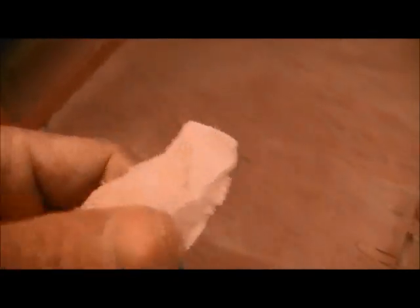It's now 20 to 30 minutes later. I have this pan out and have gotten down to the drain area. I also cut out all this excess tile and what I thought was hardy backer - it was 90% portland cement. You usually don't have these layers showing like this with hardy backer; it's usually a pretty solid piece. My thought is that these have fallen off in layers, so this is a USG building product called fiberboard. It kind of looks like fiberboard. Regardless, it doesn't really matter whether it's hardy backer or fiberboard - the process is still the same.